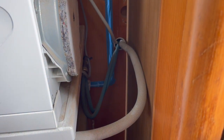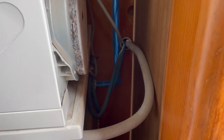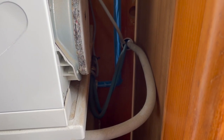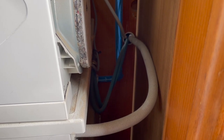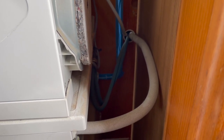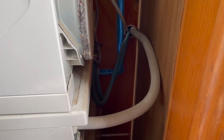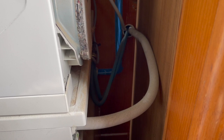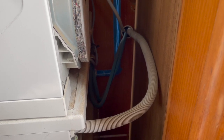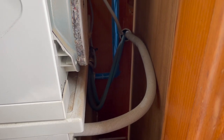The next step is here — as you can see, there's a two-inch PVC tube that runs through the wall there. That goes underneath the galley sink, and the supply for water for the washing machine, the condensate drain for the dryer, and the wastewater drain for the washer all go through that. So all we're doing right now is shutting off the water and disconnecting these hoses so that we can pull out the washer and dryer a little bit further to get access to the panel.